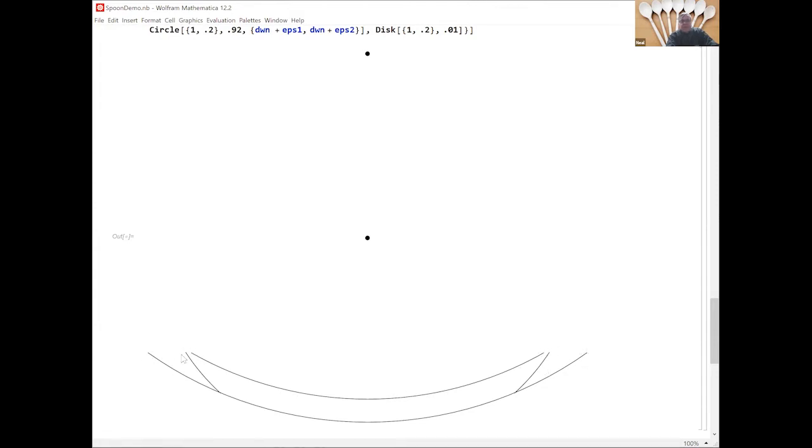Notice this gap here, or this distance across here, is much less than what the actual thickness is. So that's why I cut it the second time. That's why I remounted it and did a different radius and cut again. That way, the thickness here is the same until you get up here, and then it thins down. Then when I sanded it, it just kind of smoothed out these corners.